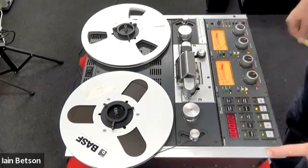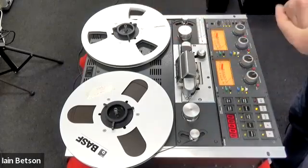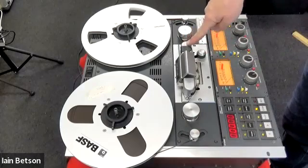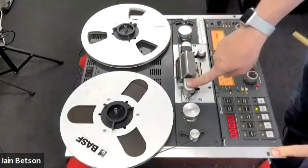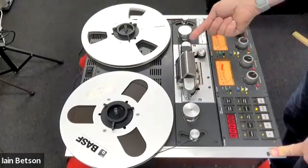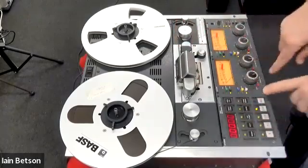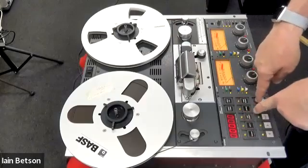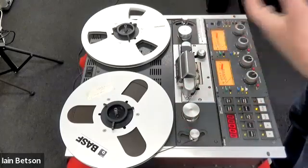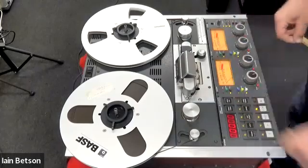The last button is called code ready and it would arm the time code, which I spoke about earlier on the connectors at the back. There is a time code head which lives just under the end of the head block. You've got your erase head here, your big record head there, your big replay head here, your capstan and pinch roller, and then the time code head lives under here. These three buttons can actually be reprogrammed via a series of dip switches — for instance you can put lock two into one of them to hold another memory allocation.